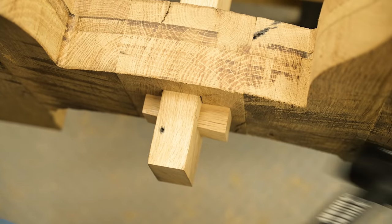So we're going to cut these down a little bit closer to final length because these are big and heavy, running through the skip planer, and then we can start joining this thing together. It's going to be real fun on the top as we're doing some breadboard ends. So that changes the math a little bit, but I've already run all the figures. Time to do this.